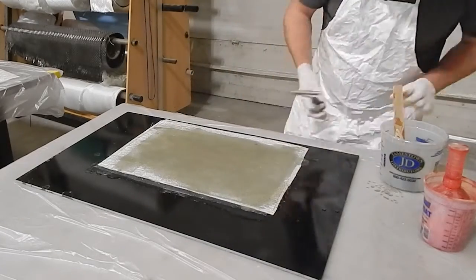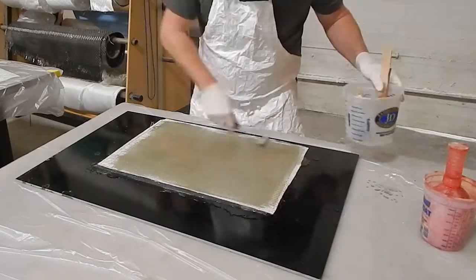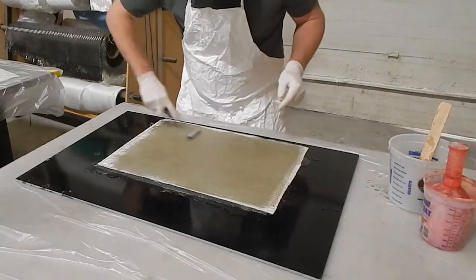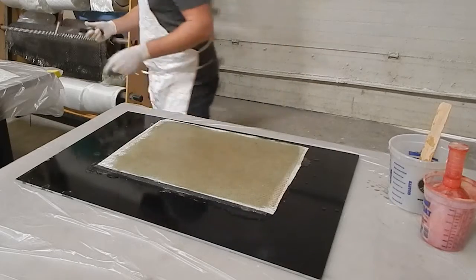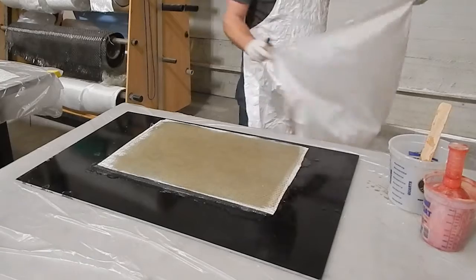I'm going back over it all rolling really nicely — rolling is key here. This is the method of laminate consolidation and getting the air out, so I'm being pretty fussy about that. And here, because this is laminating resin which has an air inhibited cure, I will put a layer of peel ply on so that I'll be able to pull it off.